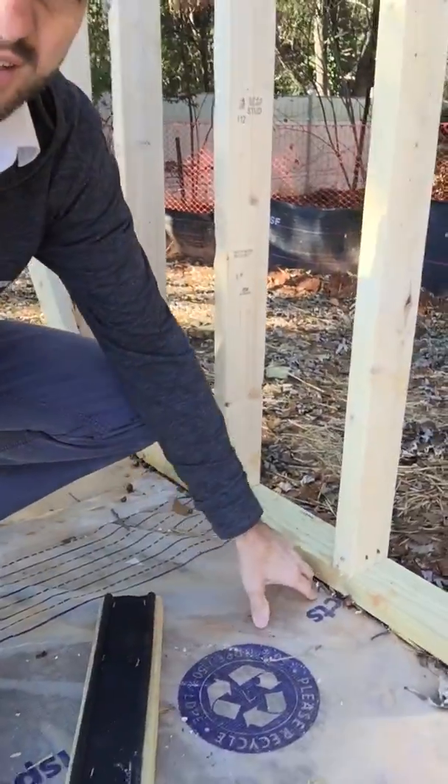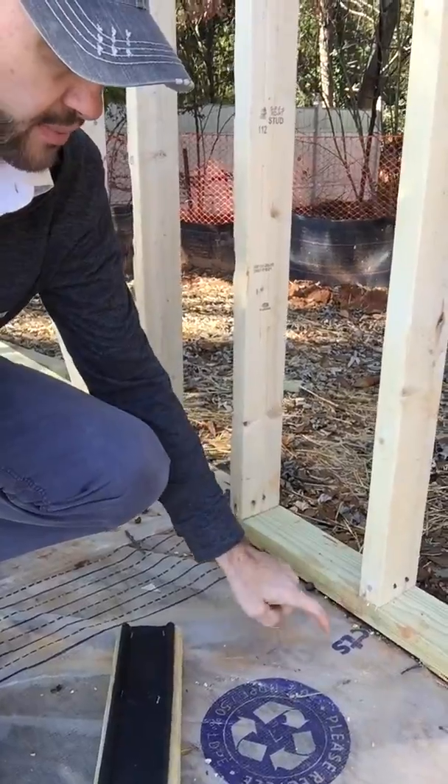The last thing I want to show you is this detail we've used on a lot of wood frame and metal frame houses. Around the base of the wall, you've got your sill plate where it makes contact with the concrete slab or with a wood subfloor. Because the top and bottom of the wall are both primary air leakage locations, we also have to deal with moisture on that bottom plate. The bottom plate is pressure treated, but we also want a capillary break to prevent any moisture from getting into the framing. One way is the Clean Runner — it continues under that bottom plate and will stay there after construction. We'll just cut it right at the edge, and it'll stay underneath. Because it's non-perforated, it will also prevent moisture from coming up into that bottom plate.